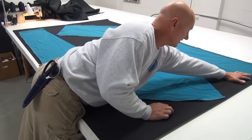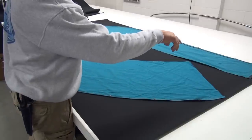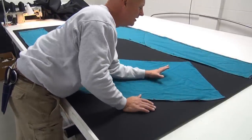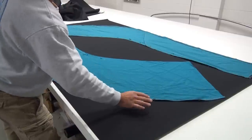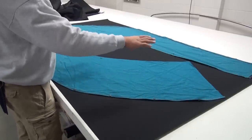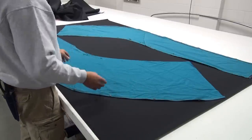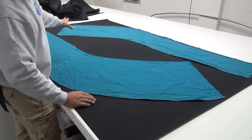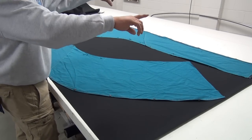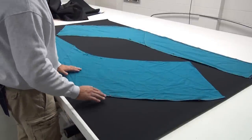on both where the zipper is, here, and there's another one over there, I'm going to just cut the canvas long. I'm not going to worry about where that lines up exactly, all right? I'll show you when we start sewing these together why that is. I'll cut these two pieces out, sew them together in the center, and then start at the center and sew this wing to the main part of the cockpit cover, and work my way around both edges. Then if I cut the fabric long, I can trim it off so that it's exactly in the right spot.